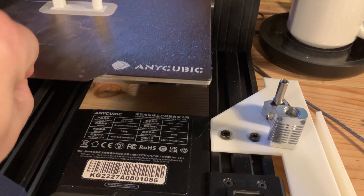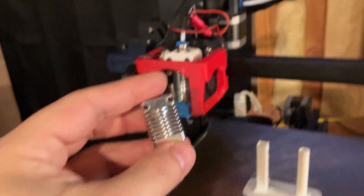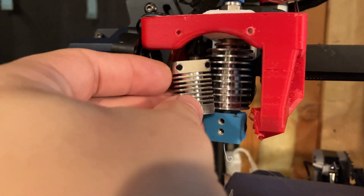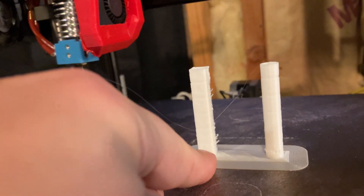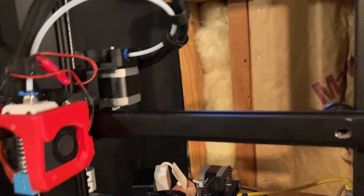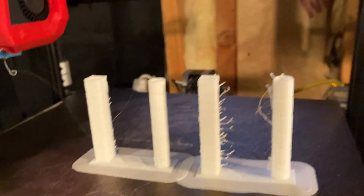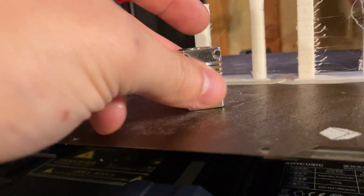So if you didn't already see the solution, at least one solution is to replace this very small heat sink with the original V5 clone design you see on other Anycubic printers. You can see just how much more metal there is for heat to move around and escape. Here's a temp tower I just finished printing from four to nine — you can see around six and seven it's pretty good. In contrast, the same temp tower with the original heat sink was a disaster. It's a thermal limitation of the heat sink design.